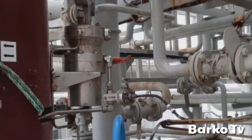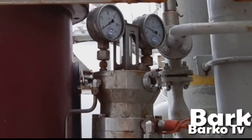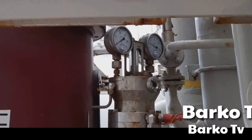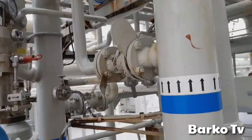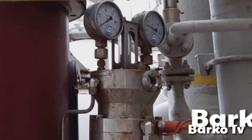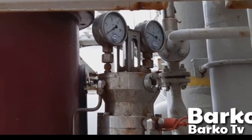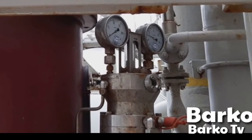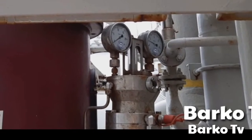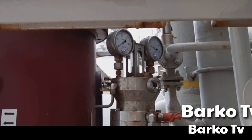A pressurized sealing oil is put under pressure both by the cargo tank and the spring. This ensures that the sealing chamber pressure is always higher than the cargo tank pressure, for maximum protection against cargo leakages. Take note: always higher than the pressure of the cargo tank.